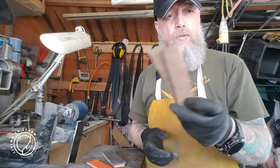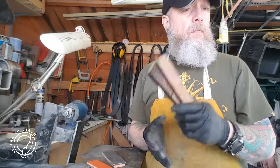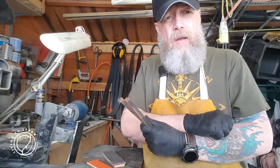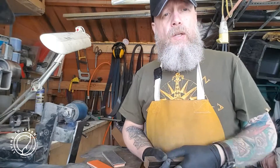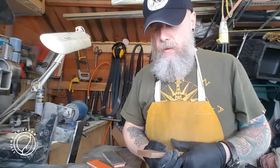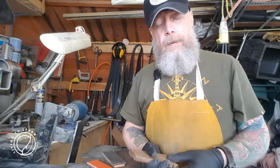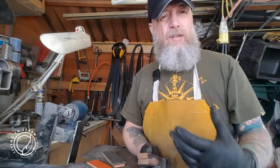Like I said, fruit wood and nut wood — like cherry, walnut, sweet chestnut — make really good knife scales and they're pretty stable. If you do want to use wooden scales, look at buying stabilised wood, because it behaves itself a lot more environmentally and it's easier to work with. You're not going to get loads of warping and cracking because the stabilising process kind of turns it into a plastic.